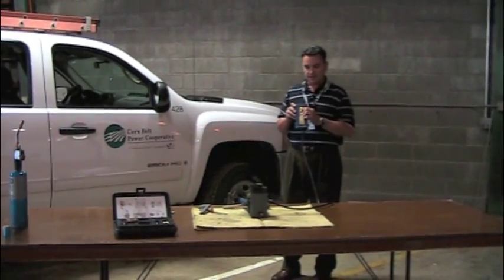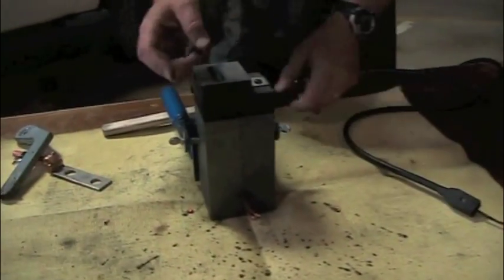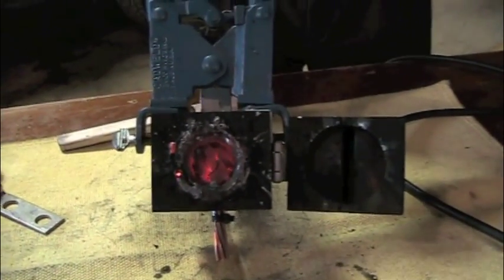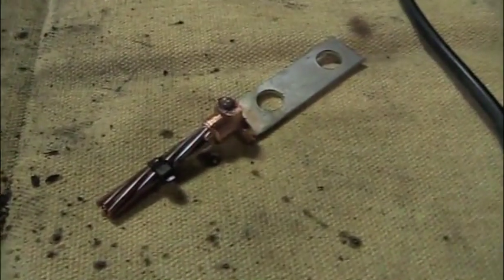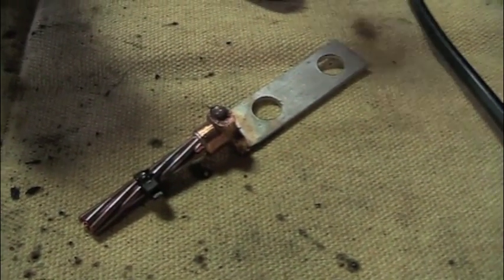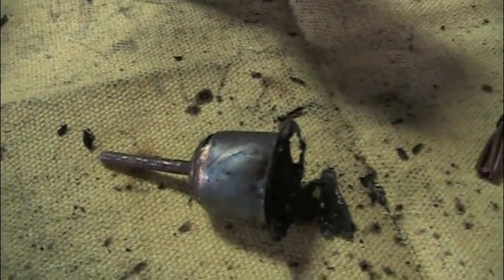Build up a capacitance, get a little flame off the mylar cover onto the reaction, we pull the igniter out. I'll open it quickly so you can see — molten copper has a viscosity of water. We drop the mold, drop the connection out, and here we have a solid welded tinned copper pad to a two-ought conductor. It goes from ambient to about 4,200 degrees in less than a second. This is the slag — the aluminum oxide byproduct — and the copper for the connection.